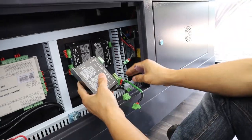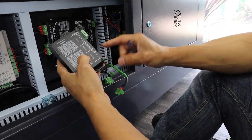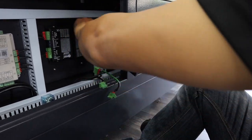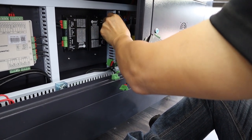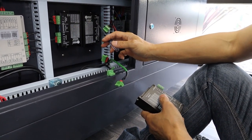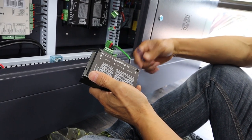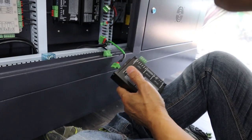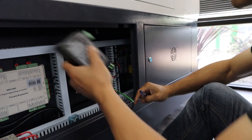Now I'm going to hook up my rotary. I'll set up the rotary on the bed — you can place it anywhere, but because my wire is a little short, I'm picking the bottom right corner. To emphasize: if your machine is already two-phase ready and not three-phase, you don't need to do what I'm doing here. I'm swapping because the rotary is two-phase and our machine is configured for three-phase.